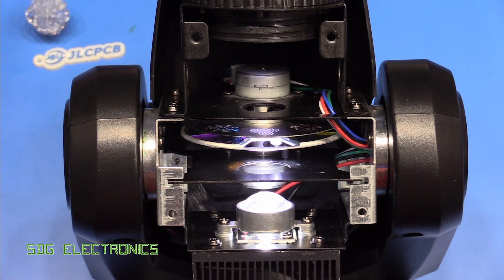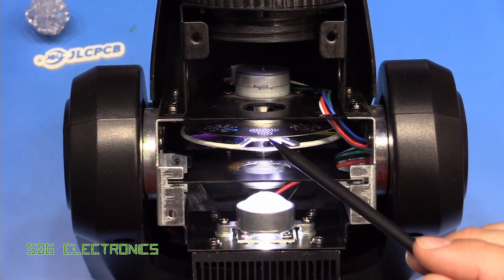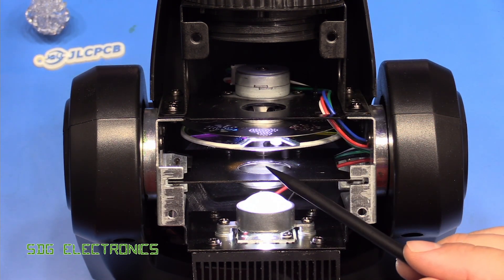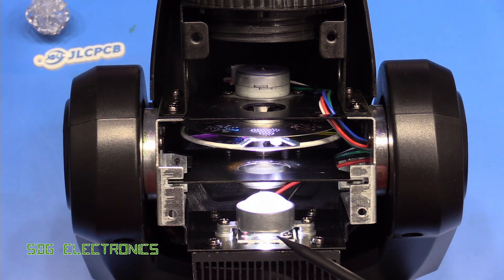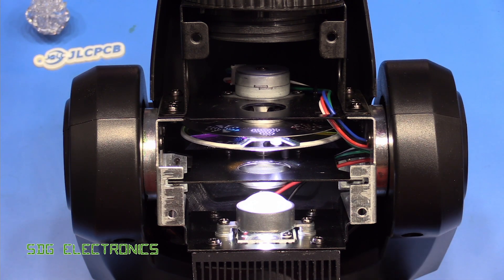Many of you probably won't have seen it, but about five years ago I did a video on a Clay Paky stage light — a 1.2 kilowatt light source with a very similar setup. It follows a lot of the same strategies: a stepper motor, homing against a physical stop rather than using limit switches, and so on. This is really just the same design completely scaled down into this miniature form factor.